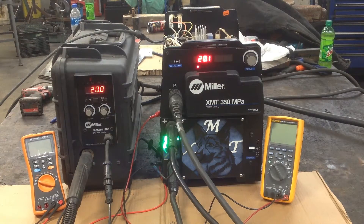Today we're going to look at what I did to help compensate for voltage drop on the XMT welder when you're using a remote suitcase feeder. The XMT is already sensing the voltage — it already has voltage compensation built in. There are two sense wires connected directly to the output lugs, 39 and 40, that's white and black, as you can see in the prints.